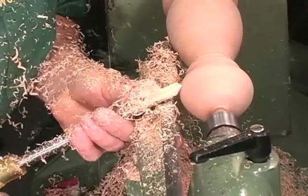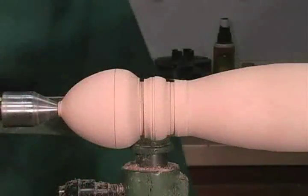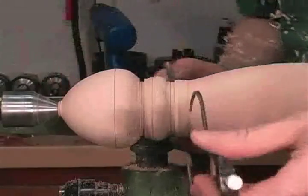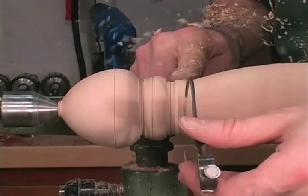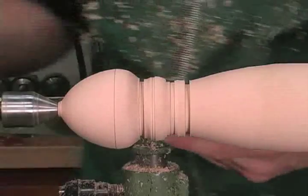Move your entire body with the form and become a part of it. I just noticed something wrong with the form — I didn't part down deep enough. I dropped my caliper before and it self-adjusted, so I'll establish the correct diameter now.